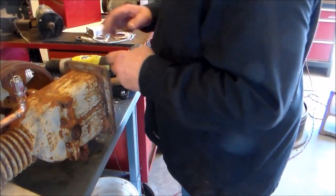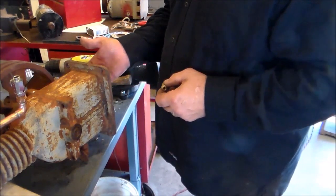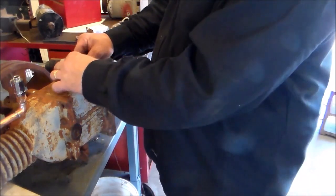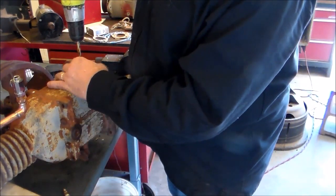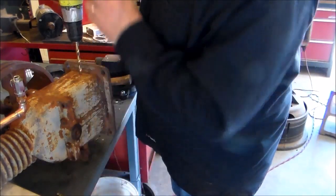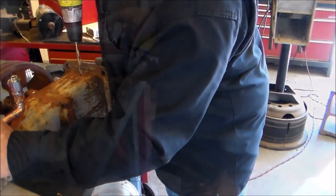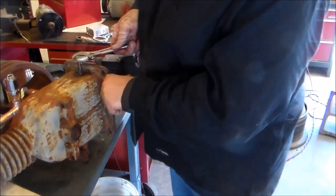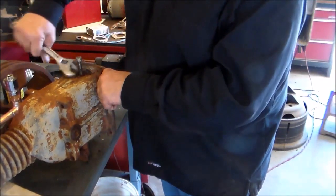What I'm gonna do is put a little one-eighth 90 in here. This cavity is open and I'm gonna make that into the gas tank, but I've got to get the fuel out and I'm gonna put a little check valve in here. I'll drill it with a 5/16 and tap it. I got that thing started and we're gonna cut some threads — you want to go deep enough that you can get your fitting started, but not so deep that your fitting bottoms out, because this is one-eighth pipe and that's tapered threads.